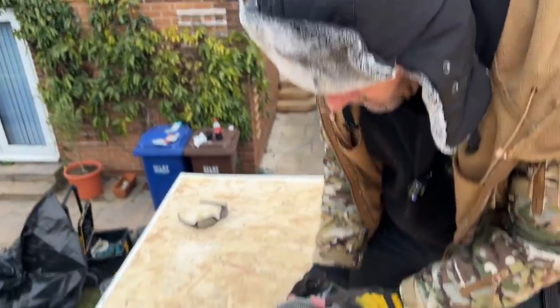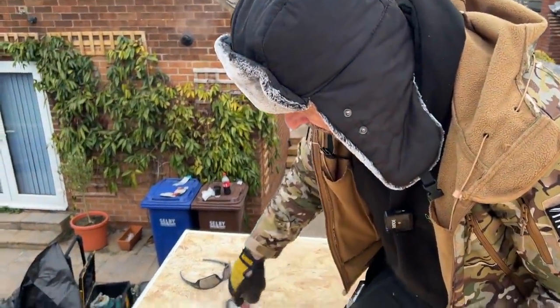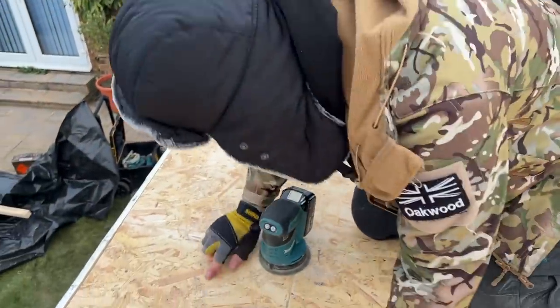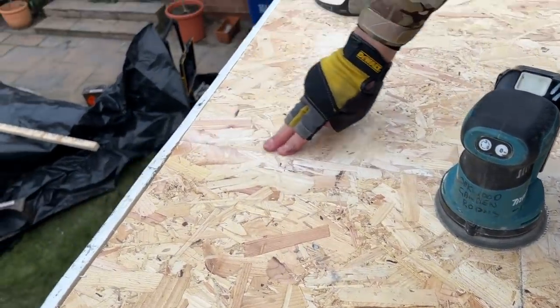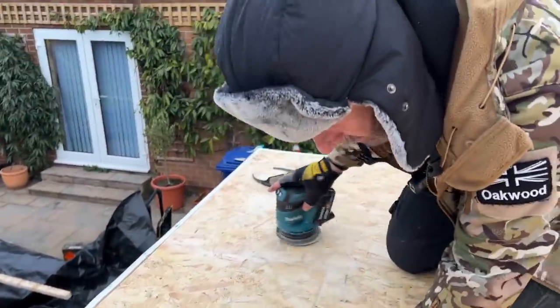Right, so we're going to sand it. We're going to use this 80 grit sandpaper palm sander. If you bought the drills then obviously you need to buy the same platform tools really so that all your batteries work. It's an 80 grit we're using there. What we're trying to do is get rid of all this bits of crap — there's a little bit of paper on the nails and any glue — we're trying to get it down to a nice smooth finish so that the rubber adheres nicely. It wants to be dust free and ridge free.